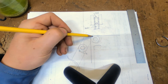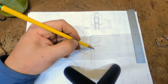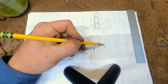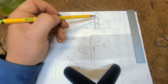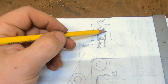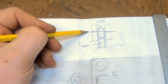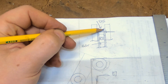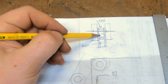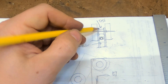These are the ears that I welded on the outside, so the handle should be able to swing all the way up against here. The nut that holds the stud is somewhere down here. Looking at it from this side, we end up with something like this — I didn't quite draw this right, but these are the ears I welded on. There's a pin, or I think it's a 3/8 inch bolt through here, that holds the die. So this is the 7/8 inch cylinder, and then this is the 10-32 threaded nut that we're threading into.